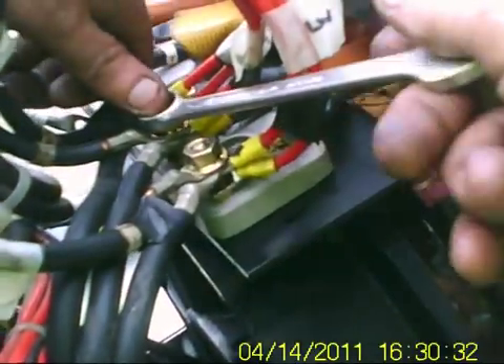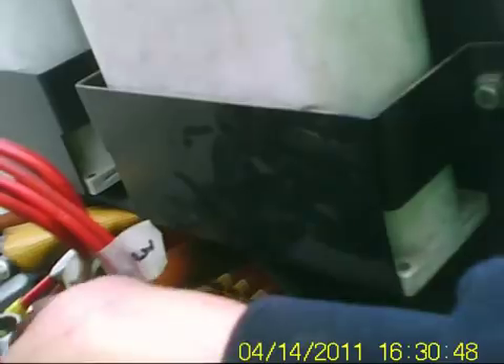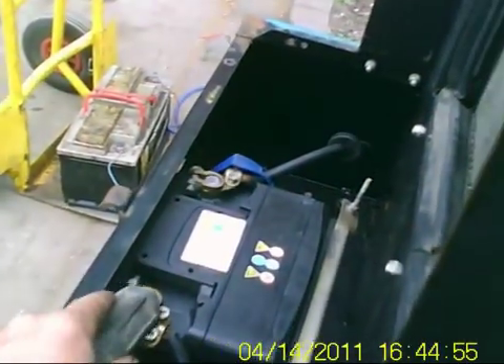Now if my tagging's right, they should all be in the right position. If they're not, this is going to be a very short show. I've got to turn the three-phase 400 volts, so I've got to get it right — we're talking a lot of volts here. Obviously nothing must touch anything for obvious reasons. What we do is basically touch one side of the battery and then flash across this terminal here.